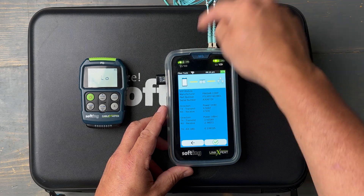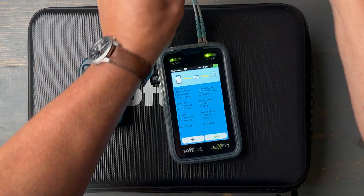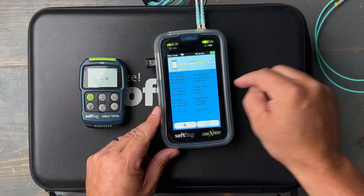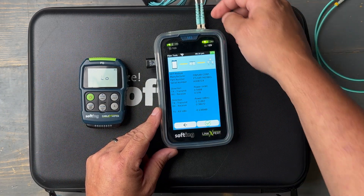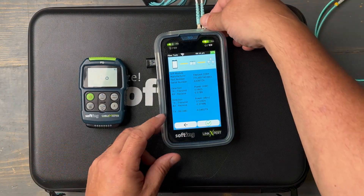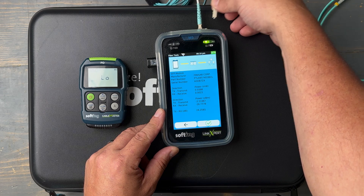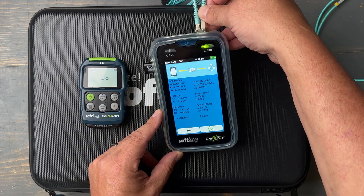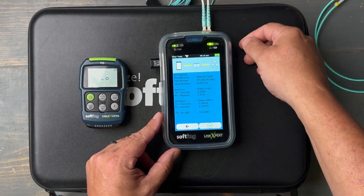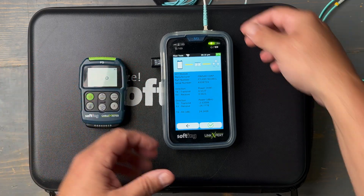There it is — I can see power in and power out. I'm just making a loop with this fiber optic circuit here. I'm losing 0.12 dBm on this fiber optic. I can test a mile or two of fiber here no problem and I get instantaneous feedback. You see how quick that is — it drops off as soon as I plug it back in, I get a quick value, my link light pops up. I can also use this basically as my fiber optic light source.